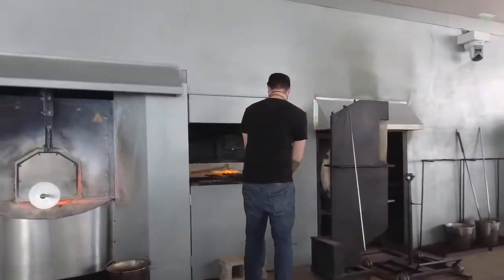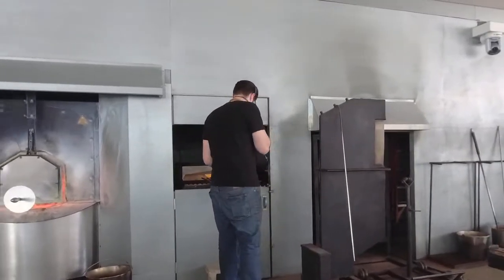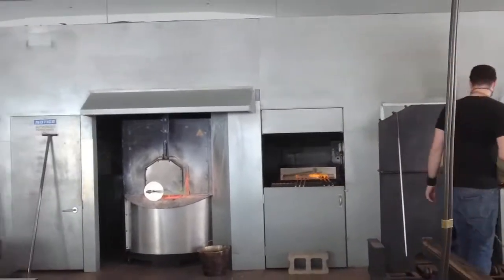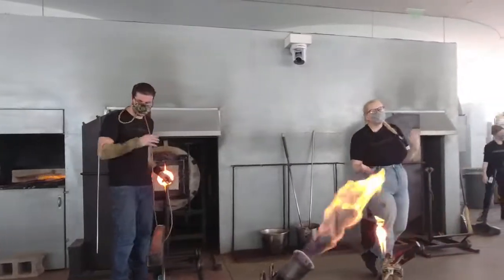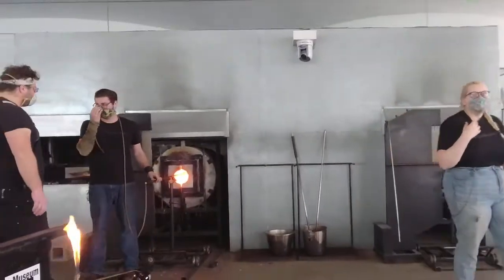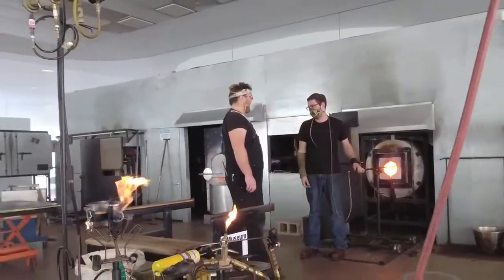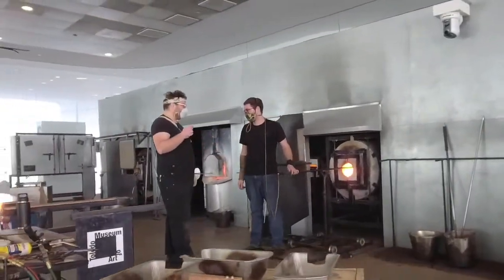And in our case, George is going to put it actually through a lot of stress in our next process when he goes to bombard it and pump it. So we want to make sure we're alleviating all of the stress out of there. So that's sitting at about 918. That's a temperature where you sort of become familiar with the state of matter of glass, right? It's not that flowiness of the furnace and also not totally shatterable in room temperature. Sort of its happy medium.